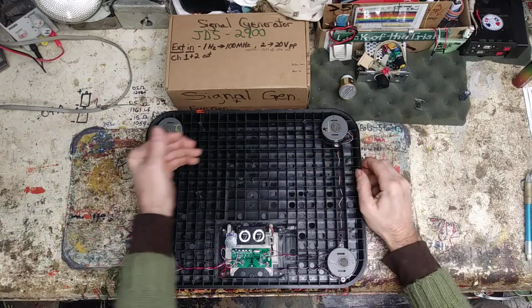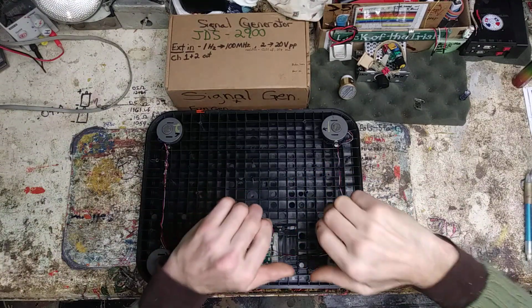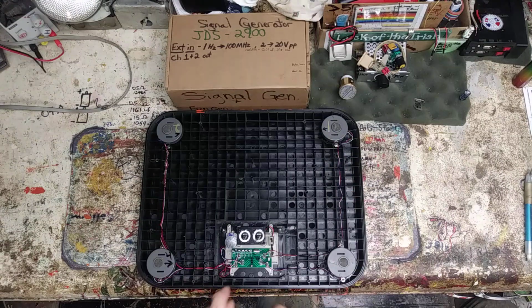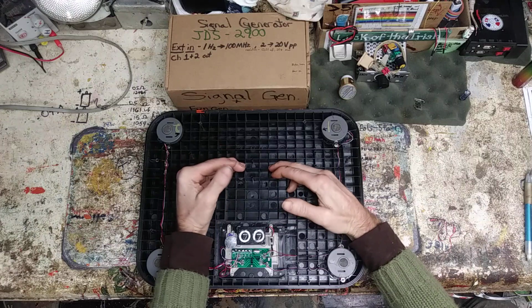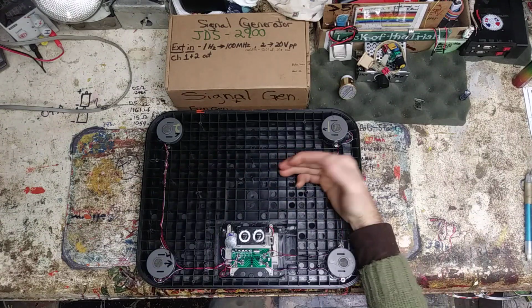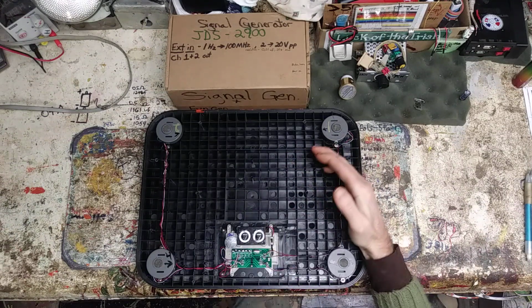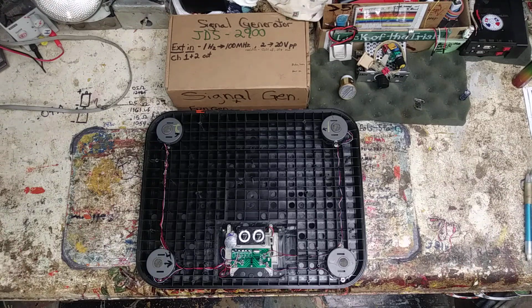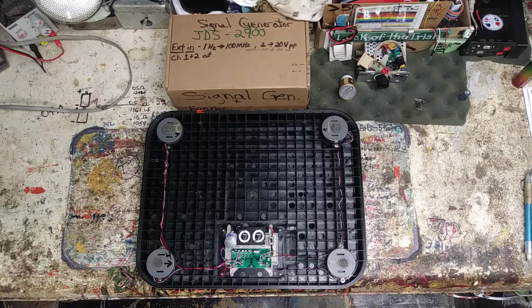They actually work as a resistor. They're mounted into the metal, and as the metal is stressed or bent, the resistance goes up. How that's measured here is, it's got a blob on the other side, and it takes all the measurements and the differences in the resistances, pops it all together and spits out an accurate weight for you. And it can do pounds or kilograms. So something pretty lame and dumb is actually kind of exciting here. I was fascinated with it, to be honest with you. I didn't even realize that it had load cells in it. I've wanted to get some load cells, in fact. Just haven't gotten around to it.